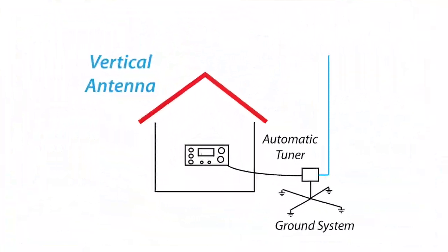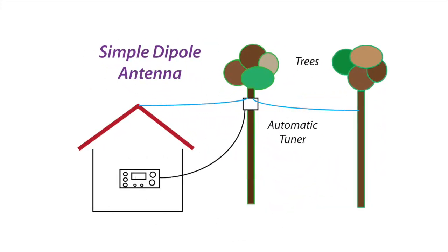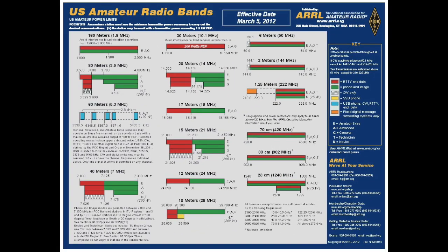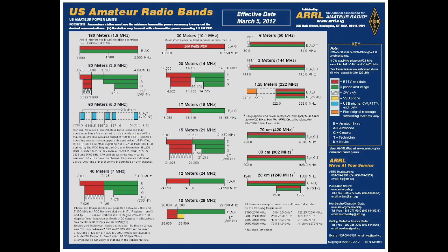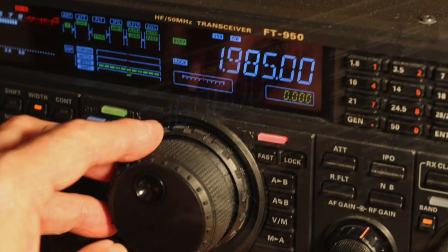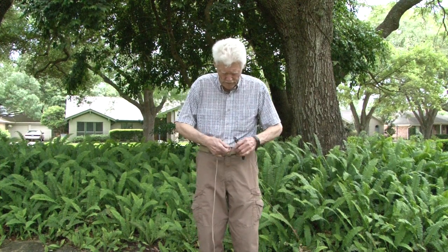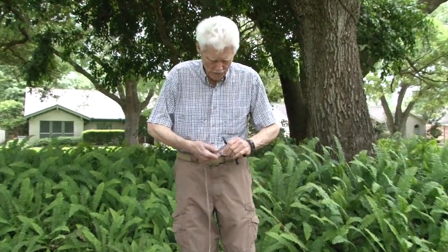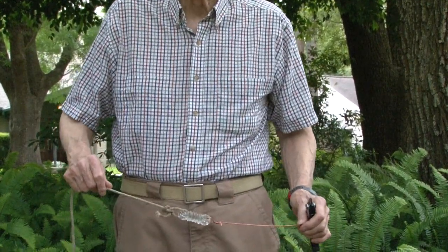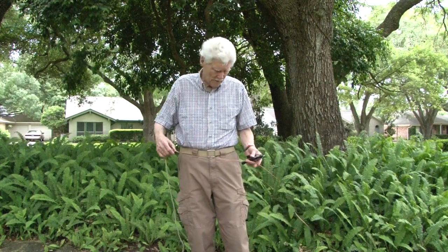Here are the basic types of antennas that you can try to fit to your QTH. These antennas should tune all of the amateur bands from 80 to 10 meters. Sometimes you might get lucky and be able to add 6 or 160 meters. It's best to have the antenna not resonant on any ham frequency, which will avoid any extremes of input impedance as you tune through the bands. If your antenna fails to tune on the bands you want, just change the length.